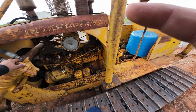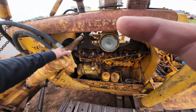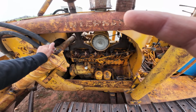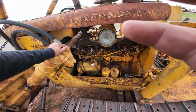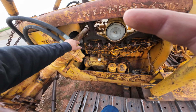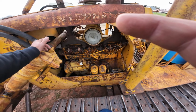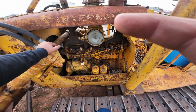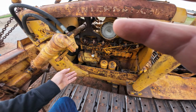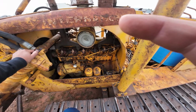Steering clutches are working. Steering brakes are working. Everything's working except I don't have the pump drive shaft. And I've got at least probably two bolts that are sheared off inside the balancer pulley. And I need a U-joint, and a few other little bits and pieces. So I'll probably have to drop the belly pan to get access to that. Hopefully it'll work out.